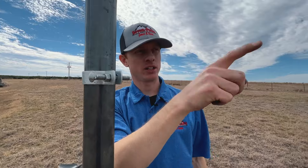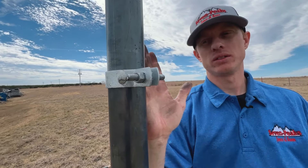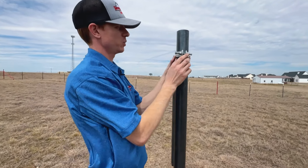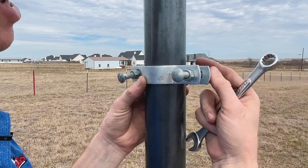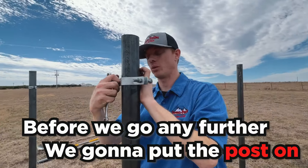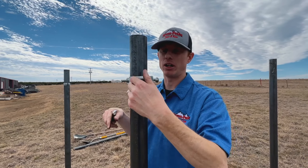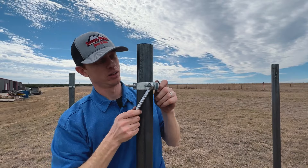You can see this post has a terminal end — that's where your fence line ends. The next post has an inline connector, since two rails pass through it. Go to the five-foot mark, same process: carriage bolt, nut, and a nut on the other side. Before tightening fully, we're going to put the rail on to check level, because if it's not right you'll need to adjust these bands. Make sure you've got them where you want them before you fully tighten.